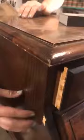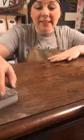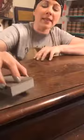Okay, real quick while you're talking. So the side, you saw me, I just went ahead and chipped this full piece off right here. It was hanging off of here. Could I have glued it on? Yes. Could I have picked it off even? Yes. That was the easiest thing, so I went with that. Okay, let's be honest here. This is solid wood here, but the top is not. It's like this shiny nothingness. It looks like it has wood grain, but there's this shellac over the top of it, right? But look what I'm going to do, guys. Take a sand pad. And yes, our paint's going to stick to it, but first I'm going to help prep it a little bit and give it a little more teeth by taking those same sand pads that I tell you guys about. I use, go to junkmonkeypaint.com if you want these same ones. This grit works perfect. Do you see what's happening there as I swirl it? You can actually see all the little swirlies, all the scratches that this pad is now putting into the top.